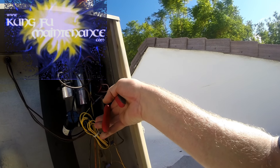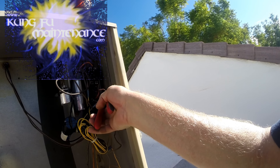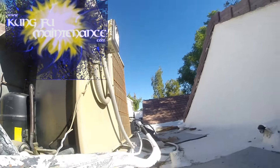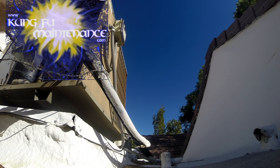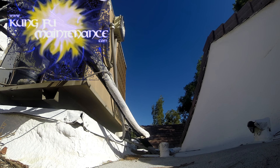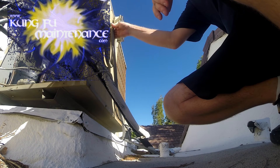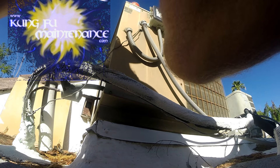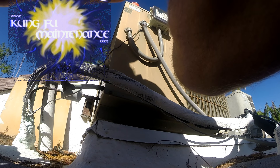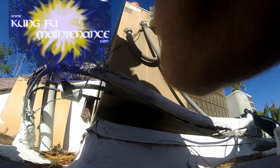It's pretty bad in there. The wiring — the sheath is completely gone. Not too bad of a repair as far as the contactor goes, but the whip itself — I probably could just run the conduit along the front and not use a shorter whip here. It sounds like the contactor is pulled in. I'm probably going to need to replace the whole whip.